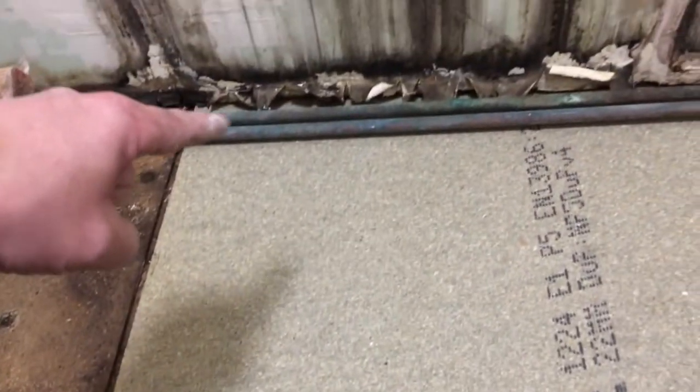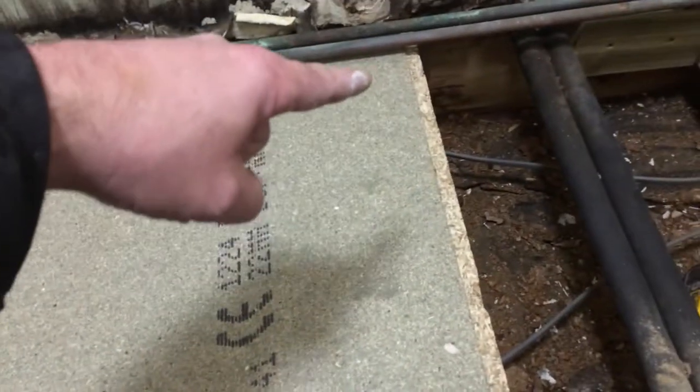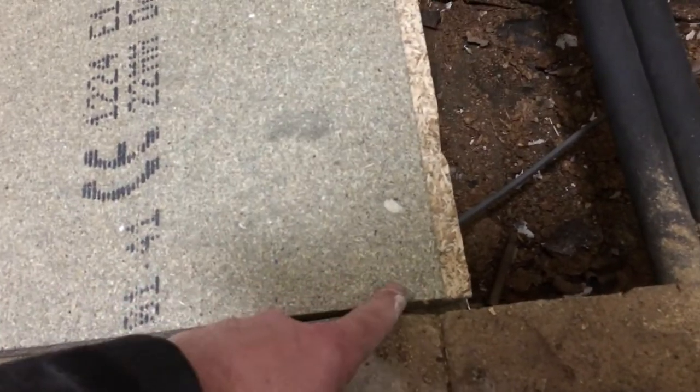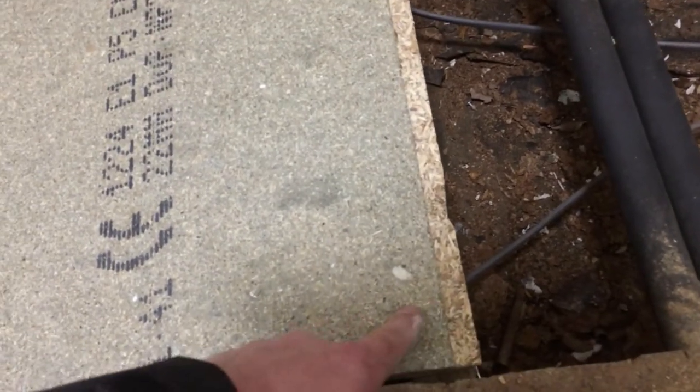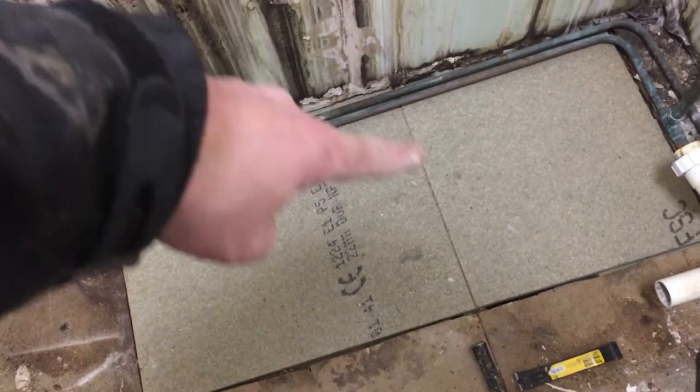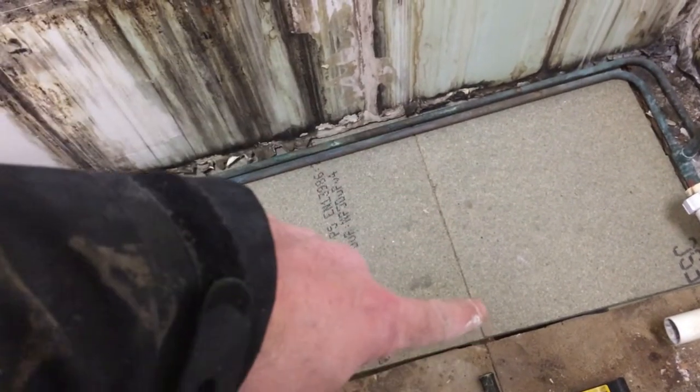So it looks something like that. There's a tongue and groove there, so it's obviously linked together. It's all boxed in right around the edge. We've got the crosshair here, it's marked 600 on centre, so the next board will go in here as well and be supported with the crosshair. That's a new section of floor now, just got it loose in at the moment. The important thing here was to get that joint right across the crosshair with the joist hangers on.